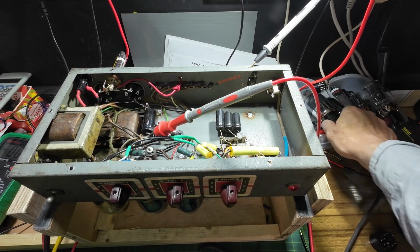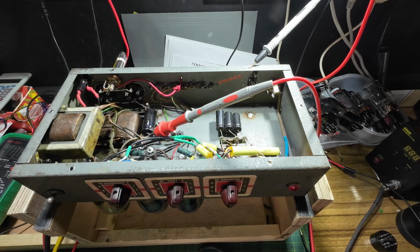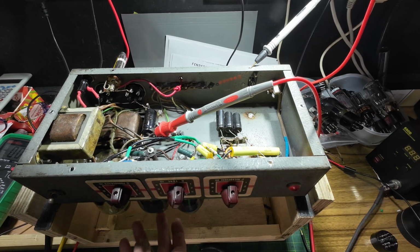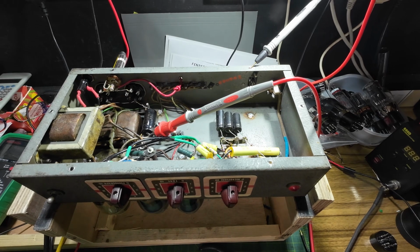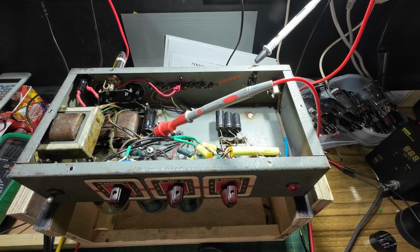And what's damaged those is those tube sockets being loose. It has absolutely ruined those tubes because they've just been vibrating away on top of the amp. And every time it's been put down, picked up, put down on a surface, it just tatters them. So they're finished, I'm afraid, which is a real shame. But at least we've got these RCAs, and we know these are cracking tubes. Remember, we had them in the tube tester. They're corking tubes. So now we've got some serious kit there.